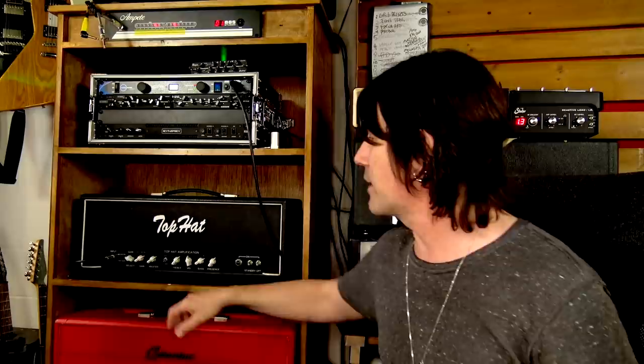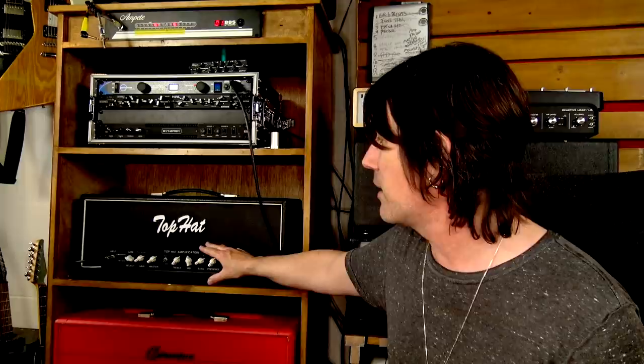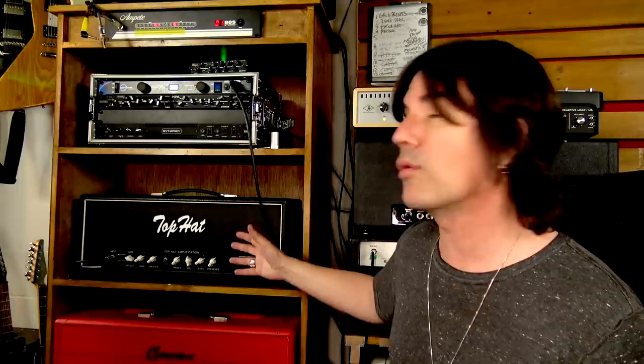The other thing on this amp is a pull bright, sort of pull boost, pull bright, that just switches in a quite aggressive bright cap. So I've got that switched on and it's in the modern mode. And I should mention, I got all really nice new old stock glass in this amp. I think it's old Mullards or Tesla power tubes and really nice stuff in the preamp as well. It is a terrific sounding amp that I bought for next to nothing like 20 years ago. I still keep it, and you're going to hear why, because it sounds great.